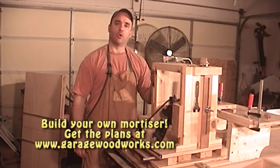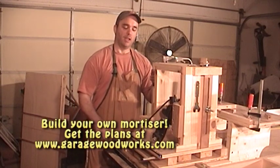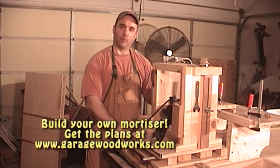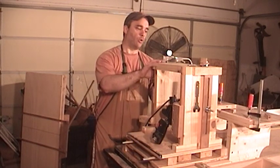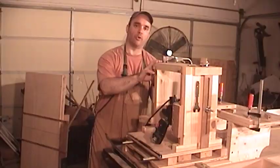Okay, for the mortises in the corner post, I'm going to use my horizontal mortiser. I've already set the positive stops on the left-hand and right-hand side of the mortiser to control the length of the mortise, and I've also already set the height of the mortise. So let's go ahead and make some mortises.